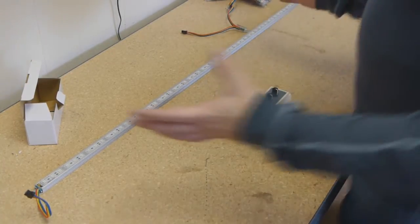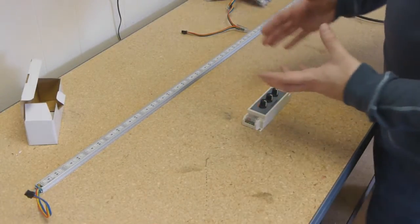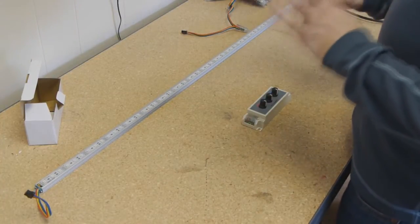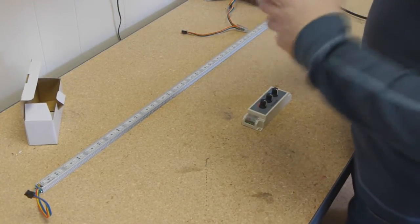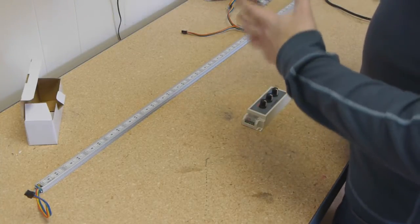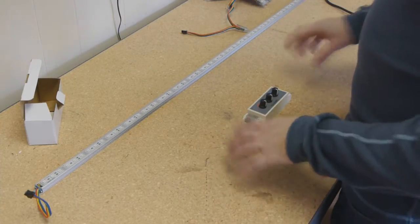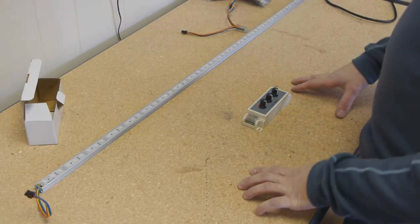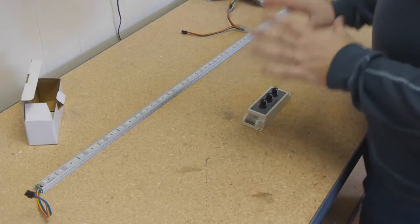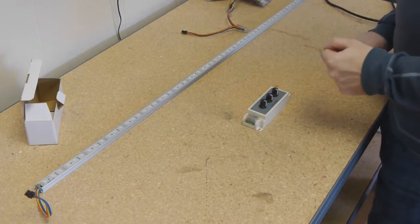Now these can be used with any of our RGB lighting nodes. It could also be used with our rainbow floodlight, our wall runner, our spotlight. Anything that is an unintelligent, quote-unquote dumb node system or dumb RGB light, this can be used to control it, as long as it's within a 12 to 24 volt operating voltage. Now each device can handle 3 amps max per channel, altogether 9 amps obviously per controller.